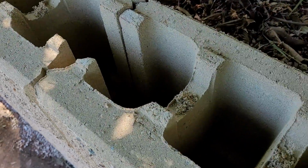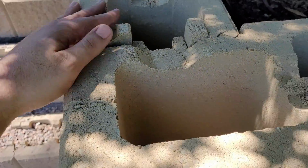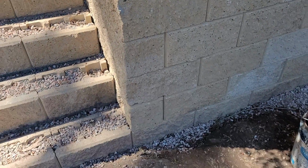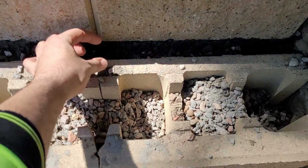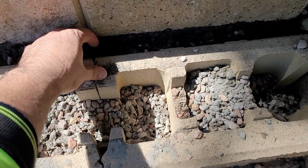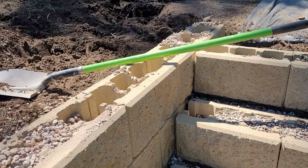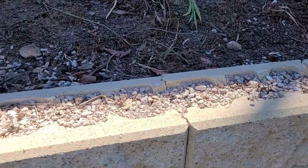Completing the wall. This part is 7 courses, and needs to be filled up with pebbles, and the corner blocks go that way. The top one is the right, and the left and the right as well, going like a pattern together. And the stairs are installed as well. We need a 5 mil gap between the stairs and the lower stairs to fit the cap inside. The stairs will also be filled up with pebbles. Then the last one is the corner blocks. This is the last one, 7 courses. This part, fill it up, and then going there.